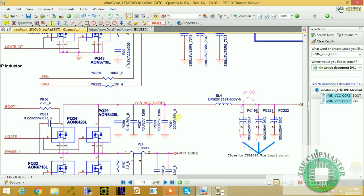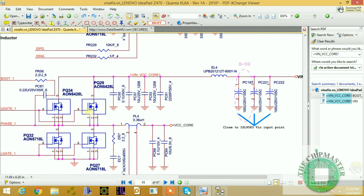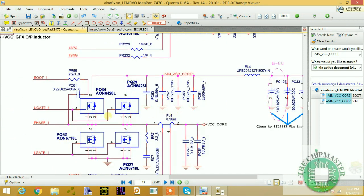interference. Because the CPU current is so large, many times these upper MOSFETs will burn. This is why they have two MOSFETs for the upper MOSFET, because of the large amount of current, right? If they used one for the upper and one for the lower, and this is damaged due to overcurrent, then we have another MOSFET here that can work, right? If there's only one MOSFET and it is damaged, then you'll have a short on the 19 volt rail because of the board flex and the amount of current being generated in the CPU power supply. That is why they put two upper MOSFETs here and two lower MOSFETs here, because